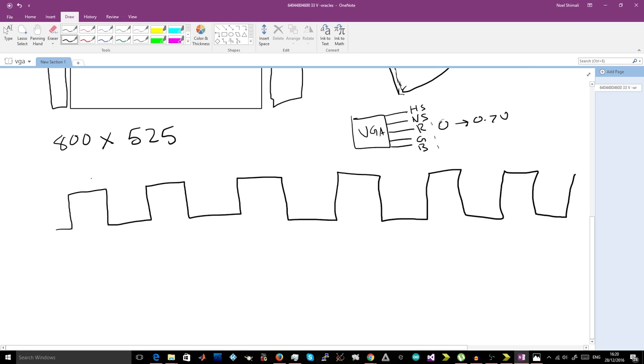So here's our 50 meg clock, and since it's... What I wrote was a clock event if. Clock event means, or anything event means, a change. So here's where it changes. On the rising edge and the falling edge is the change.